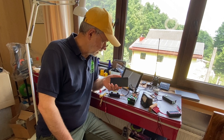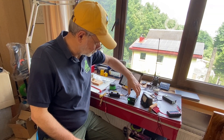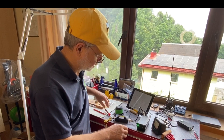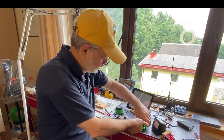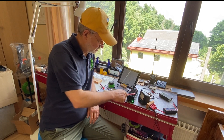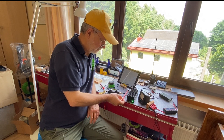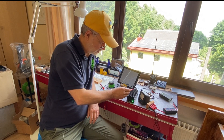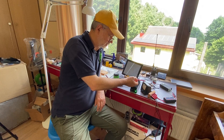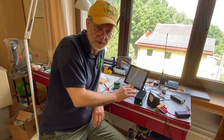It's a very nice kit to assemble and a very nice power amplifier to use. Before use, of course, you put the lid on and fix the four screws. You have to use this power amplifier in this orientation — it's important because the heatsink is on this side, and the power transistors, the final transistors, are fixed to the case and heatsink from this side of the PCB. Heat naturally goes upward, so using it the right way protects the PCB from getting too hot. The only inconvenience is probably the power supply requirement.